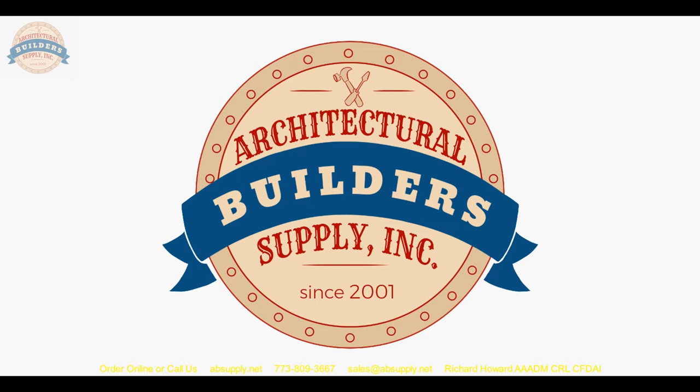Let's wrap up. In conclusion, this is a mortise cylinder generally used in a Yale mortise lock. You can also use it in key bypass switches, alarm control trims, and exit devices. There are four primary mortise cylinders: the peanut cylinder at three-quarter inch diameter, the standard mortise cylinder at one and five-thirty-seconds inch diameter, the master ring at inch and a half — also known as a jumbo cylinder — and the mogul at two inches. The one and five-thirty-seconds is the one we all use, but those other three types exist as well. In the hardware industry, you will probably come across a master ring at some point, or a mogul cylinder if you are doing any detention work.